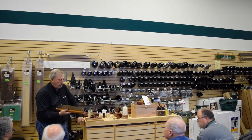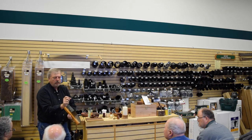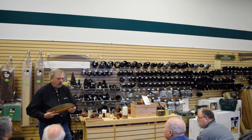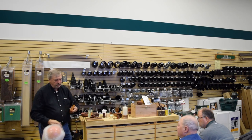A combination blade, which gives you a dado bottom, flat bottom, 3/4 inch down. And then I measured and I found that one side was about this much wider than the other side. Marked it, took it through the planer, 2 passes, bam, now these things are exactly perfect. Before I glued it in here, I took it to the router table, routed all the corners, and then I took it to my 12 inch disc sander.